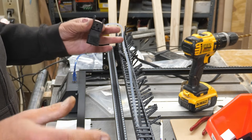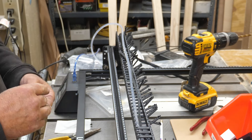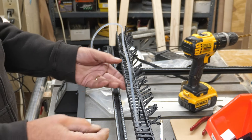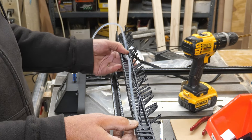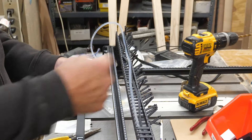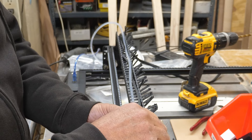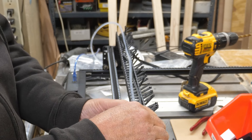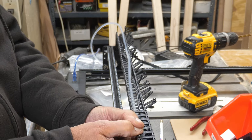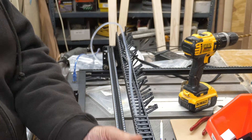I looked at doing this a couple of different ways — this is the only way I can do it without having to lengthen the cable. If you've never used one of these drag chains before, the type I buy — I'll put a link in the description — has little hinges with small things to snap open. You'll need a little screwdriver, and after you get your cable and hose in it, you just go down the line snapping them all shut. I have a lot of these I haven't snapped yet because it was still in trial mode.